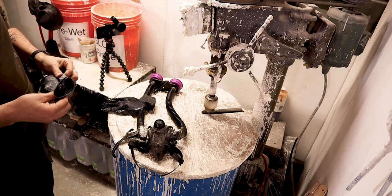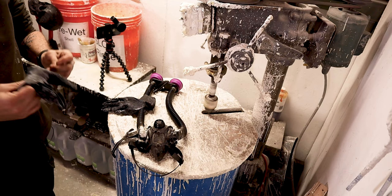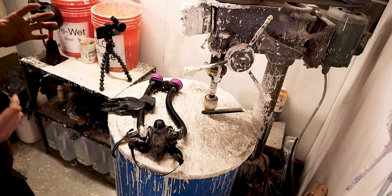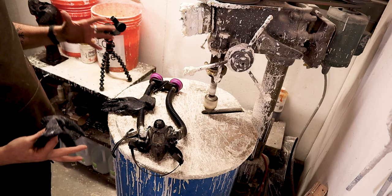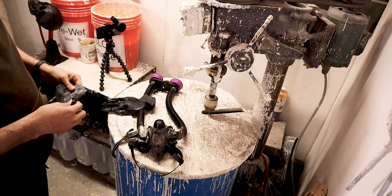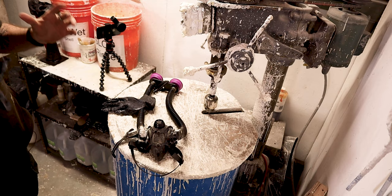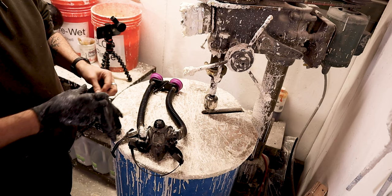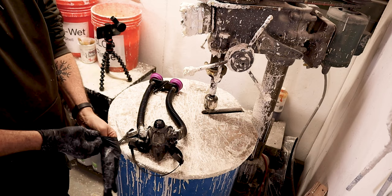As we get ready to start our dipping cycle, we're going to do 10 dips. I have my slurry mixing in the background — as we've talked about in previous videos, I use a slurry with a suspension agent so my mixer doesn't run 24/7. I turn it on for about five minutes before each dip and otherwise the tank sits stationary. We'll turn that off so you can hear me better. With this material I do want to use rubber gloves, and I've emphasized several times that with all the silica in the air we really need to be wearing respirators.